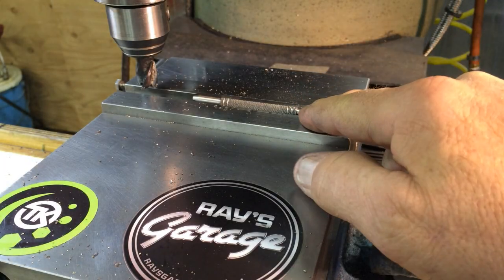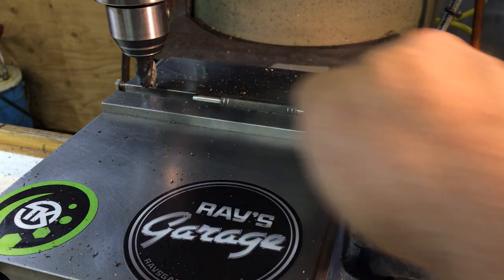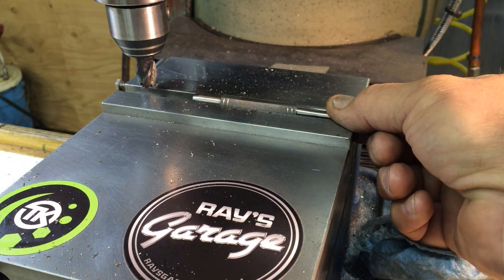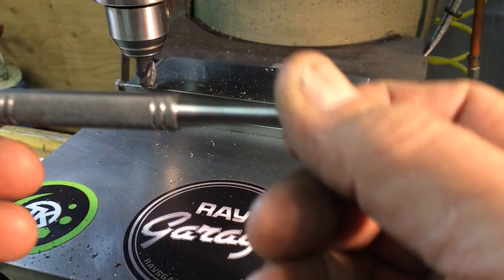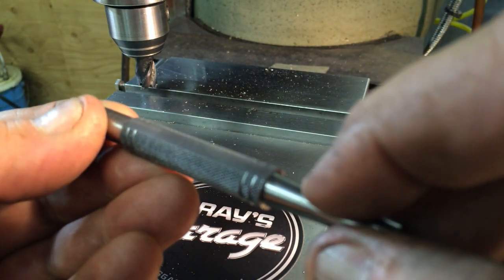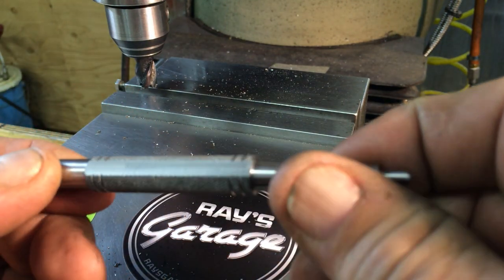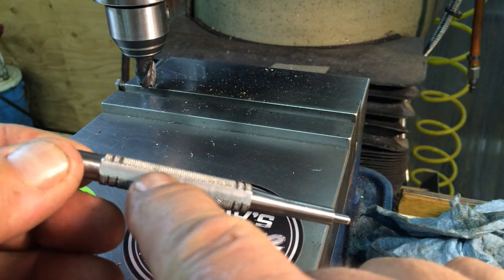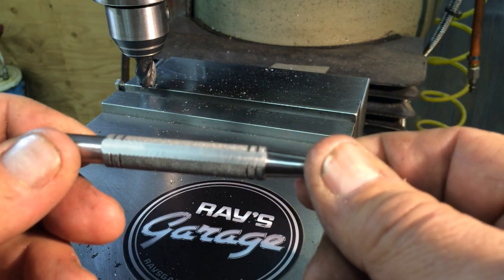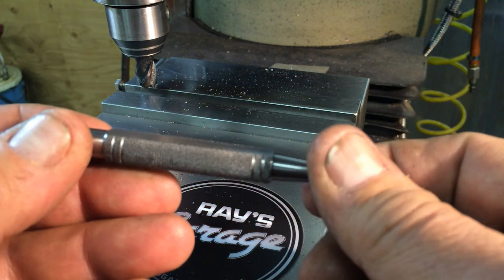I forgot to set the camera up. I just laid it in here on top of a parallel to do this flat and took off 15 thousandths depth of cut on the flat — that was just perfect. You don't want to touch the machining here or here. That way we have a nice wide enough spot to maybe engrave the size, and we're thinking of something about what's in your box. So we have playing room there to do some engraving.